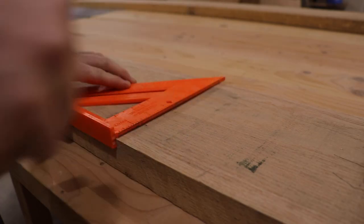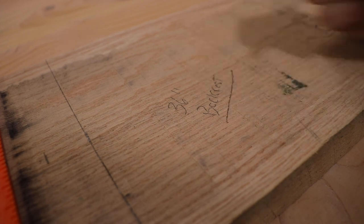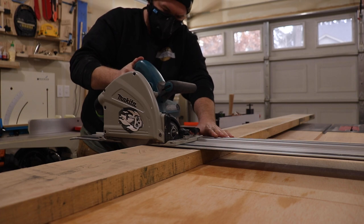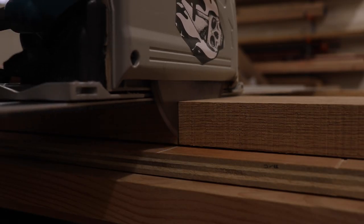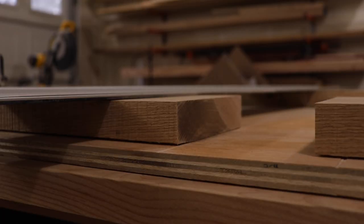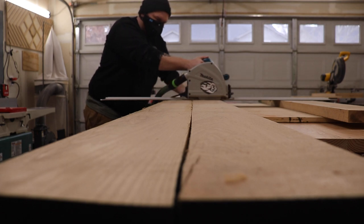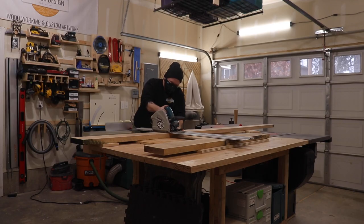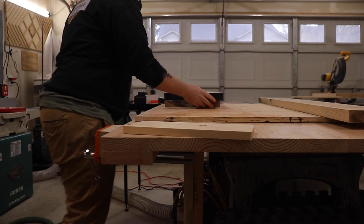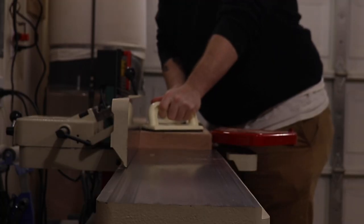The first thing I want to do is start breaking my material into more manageable pieces. Here I'm laying out which pieces are going to be for what part of the bench, then breaking them down and setting them aside so I can mill them up a lot easier. The bench legs are 14 inches, so I'm cutting 30-inch pieces for the legs and then cutting those in half — it's just easier this way.